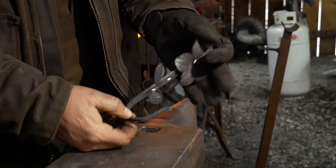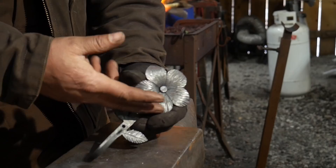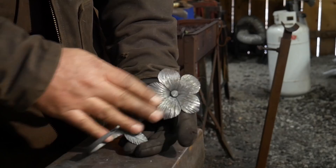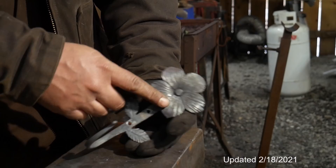And there you have it — your finished hook. For finishes, you've got several options. You can brass brush it, which gives a nice look, then cool it and clear coat it — that's most likely what I'll do here. You can leave it natural and do a hot waxed finish after brass brushing, or wire wheel the bloom until it's really silver-like while leaving the stem all nice and blackened out. Again, I leave it to you to do however you like.